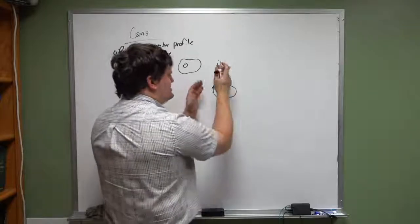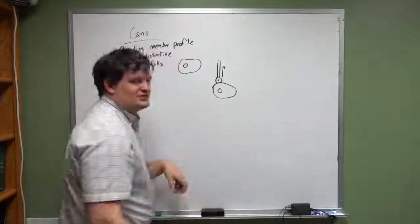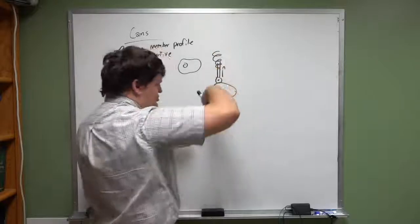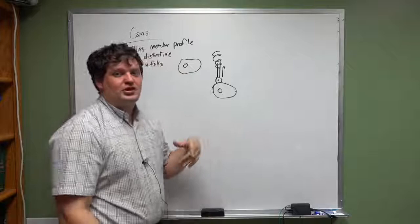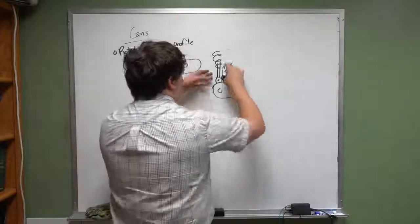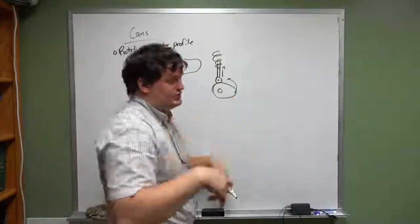If you rotate this upward, obviously with this hump, it's going to push this follower upward, because this follower is probably connected to a spring that pushes it down. This is how valves work on your car. Your camshafts affect valving. As this rotates upward, it pushes this upward, which would open a valve. It goes back down, closes the valve.